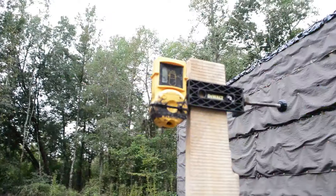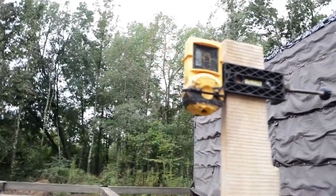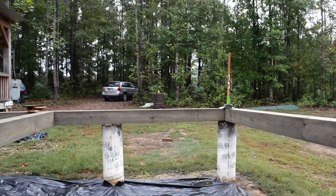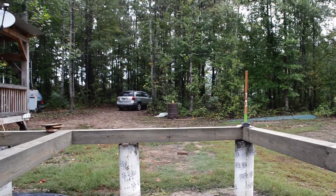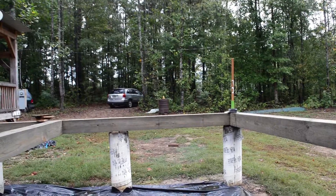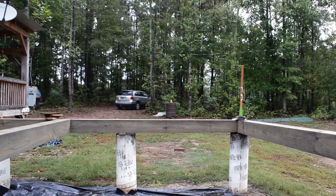So if you don't know, this is a laser level, and this is the receiver here. And if you look over there where we set it up, that is the unit that shoots out the laser. You level it — you might be able to catch the ray from here. It shoots out a laser in a circular pattern, exactly level, once you level the unit.